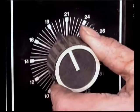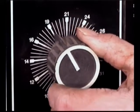Once the amount of heat and weld deposit is determined, the second part of adjusting the voltage and wire speed is tuning the arc length to provide a stable transfer of filler metal into the molten puddle. This adjustment can be made on some practice metal, adjusting either the voltage or the wire speed, as long as the dial is a rheostat and infinitely adjustable.